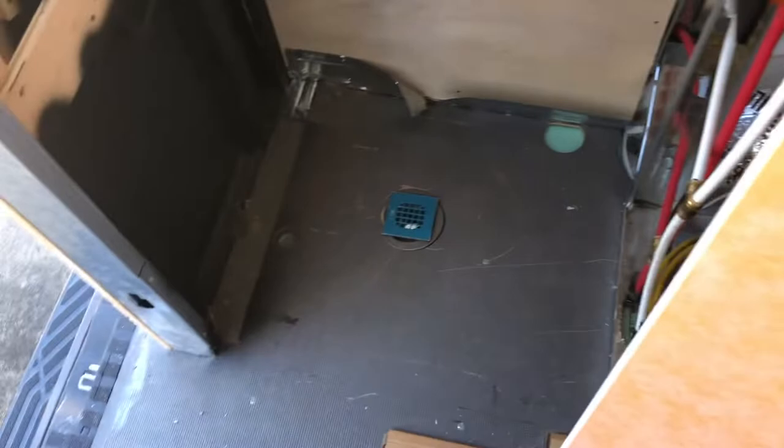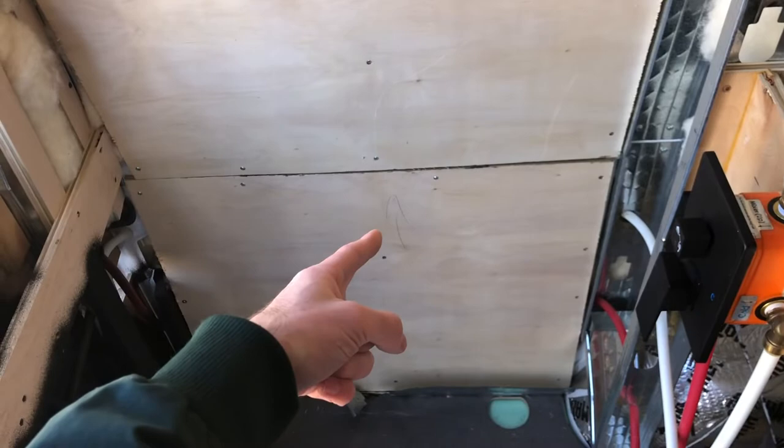So my first step is to install this shower pan. When I put up the walls, I already put up that wall. This membrane is going to run on top of the plywood and run into here. And then the KERDI-BOARD system has little corner strips that'll seal up all the edges — they actually have little 90-degree corner pieces that'll go in all my corners, on the ceilings and all that. And that'll waterproof everything. So let's cut it out.